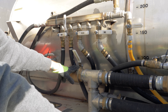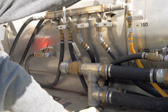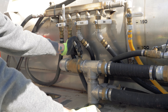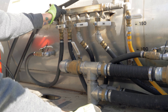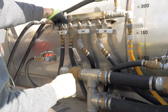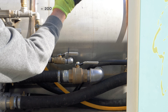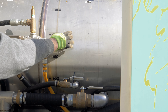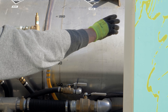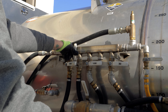So if you wanted to move water from the 300-gallon fresh water tank to any one of these tanks, it has to be on. Right now, because the 125A large valve is open and the 125A small valve is open, it's operating off the middle tank, the 125A. And they're all labeled — the valves are labeled, the tanks are labeled — so there's no confusion.